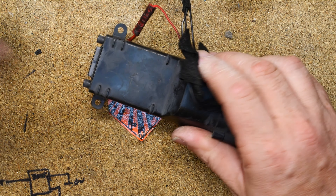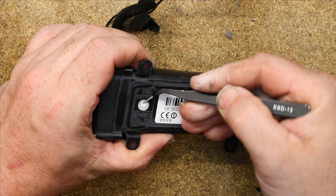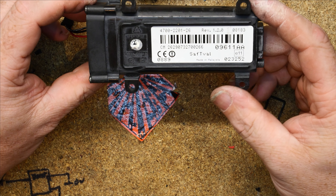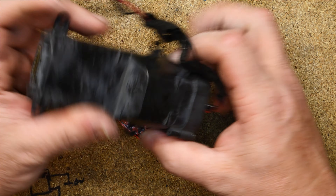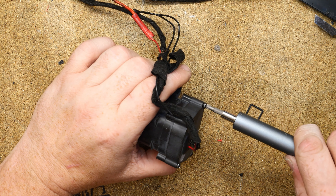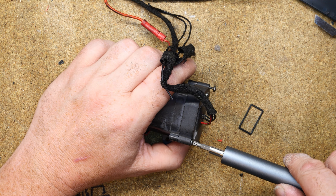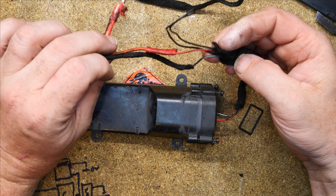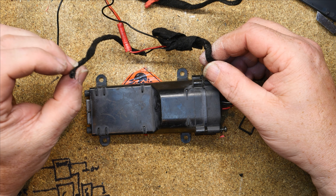Let's have a look at this second unit - it's a nice solid unit, it's heavy. I wouldn't be surprised to find this to be completely potted. We have a seal there to allow some kind of breathing. Saft Val is the manufacturer. It is E-marked. Let's take the only screws we've got out. Now quite often with these they have the ability to disable the vehicle, but with just three wires here the black wasn't doing anything - that could have been a control and that was grounded.